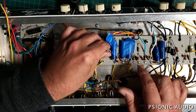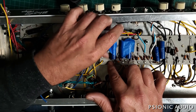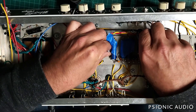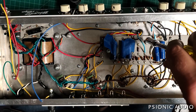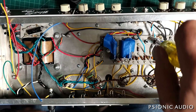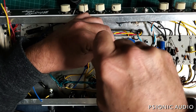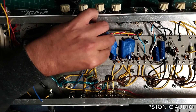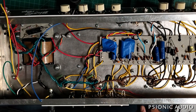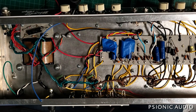Before, when I just had to replace those wires, I ran them beneath the board like it would have been in 1962 or whatever - because it's nice and I could do it. When you have a more complicated circuit like this that you may need to service at some point, I think it's better to bring it out in the open. So I'm just going to prep the wires and strip out some of the ends.